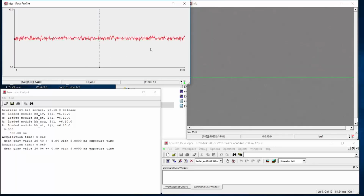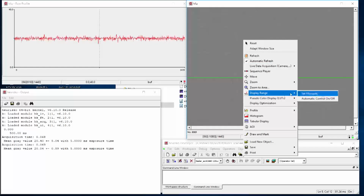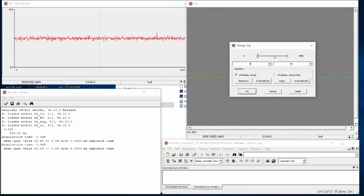And on the other side, you can see that there is almost no change from pixel to pixel in the dark signal. At least the temporal noise is dominating it. Another important question for the quality of a camera will be the relation between the temporal noise and this non-uniformity, for instance, in the dark signal. So let's go back to our original setup and look now at the question of whether we really have light in our image. Oops, let's do it this way, it's easier.